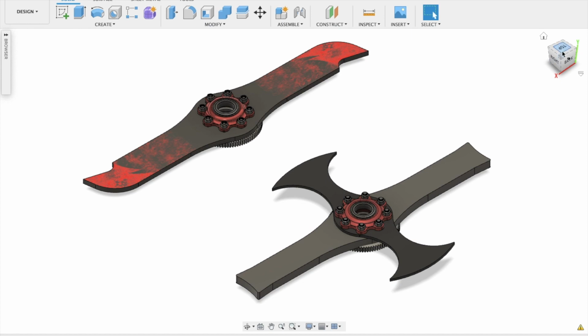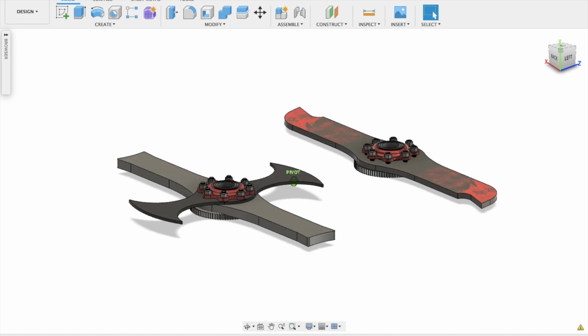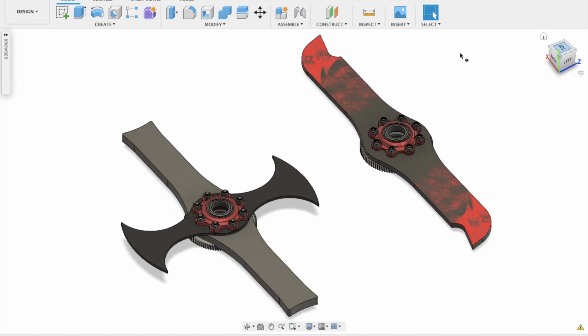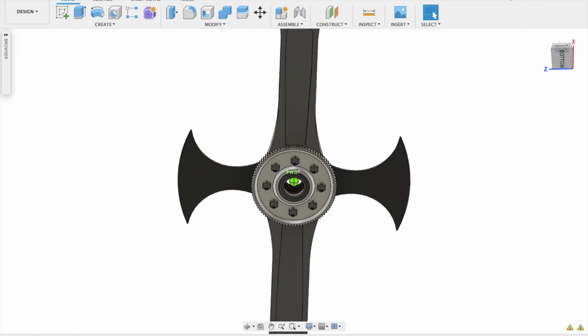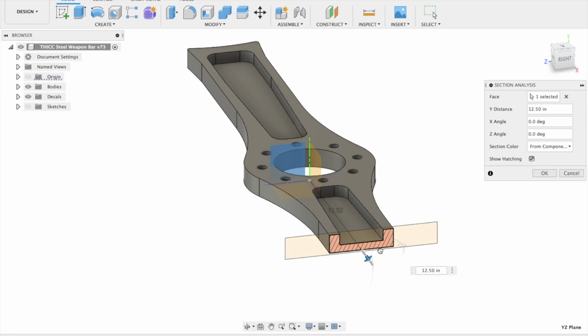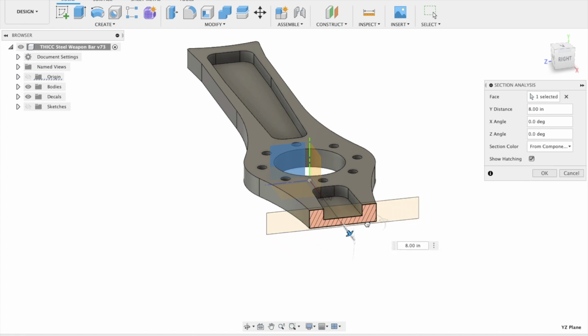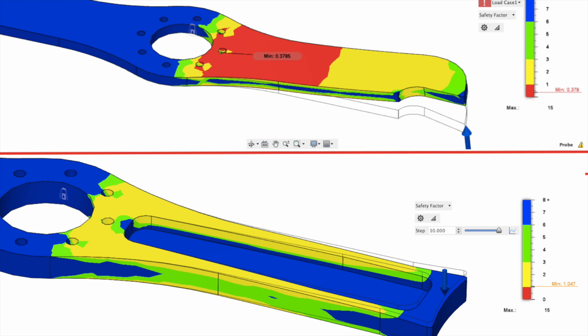While the long bar was 3/4 inch S7 tool steel, the THICC bar is 1.25 inches thick. We don't have weight for a solid 1.25 inch bar, so we designed pockets into it while still making it stronger than last year. The idea is to shape the cross-section of the bar like a piece of U-channel, and then widen the walls toward the center of the bar where the bending loads will be greatest. In the simulation at least, it's an improvement.